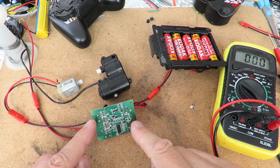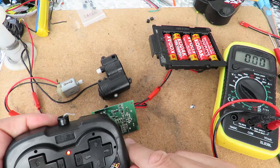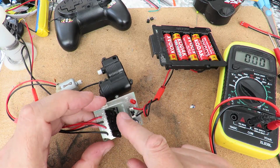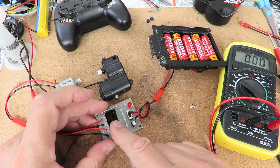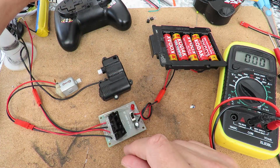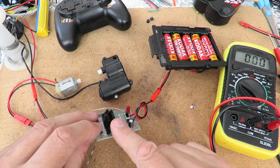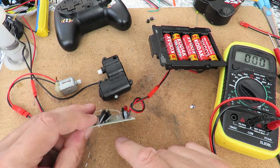It just seems it's still in working condition but it won't bind. No matter what I do, this is not seeing that, or that is not seeing this. I'm no further forwards, other than I do know I've got a useful H-bridge here. I could potentially use that part of the circuit on something else when I kill the H-bridge on one of them. There are quite a few videos of people doing Arduino projects where they use an old toy-grade receiver board to make use of the H-bridge. You can search for Arduino and H-bridge and you'll find the videos.